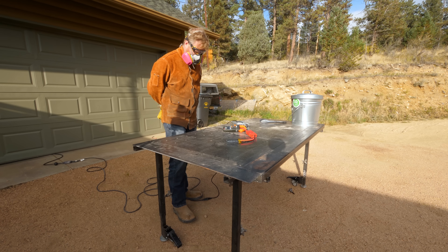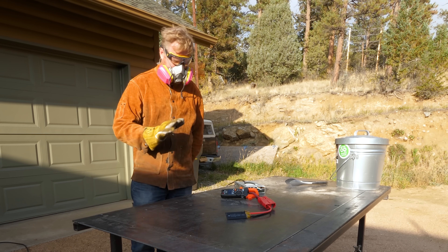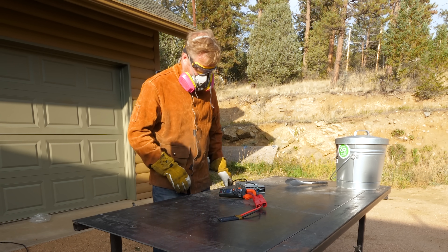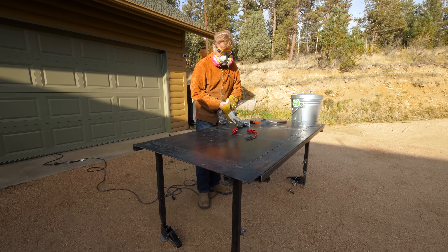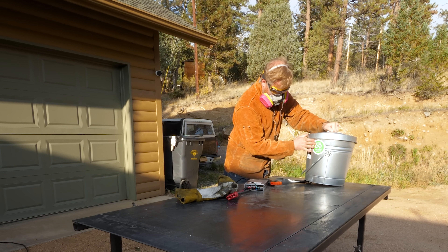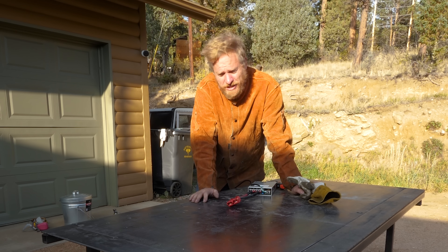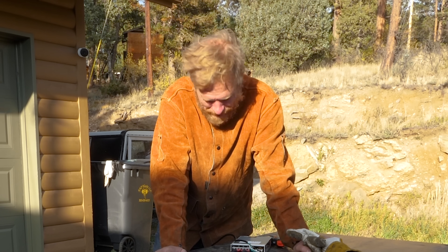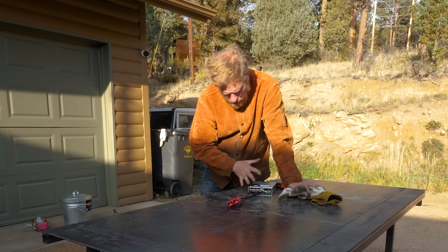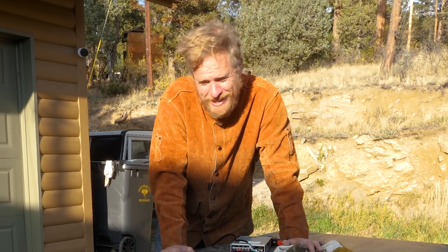It's only charging at 1.5 amps — really not much more than a normal charger. I'm going to stop it once it gets down to one amp because I don't think we're going to see any fireworks here. I'm going to call it there. Just being extra careful, I don't want this thing to explode on me — I'm not expecting it. I'll put the battery in a bucket of sand just in case it has thermal runaway later, inside a plastic bag so it doesn't short out from moisture in the sand. That did not go the way I expected. I expected to have a lithium battery fire. So that's a 1.8 amp hour battery, which means at 1.8 amps it would take an hour to charge. We started at maybe 4 amps and came down past 2, so had we kept charging it, it probably would have taken an hour, hour and a half. But in my opinion, we can still do a lot better than that.